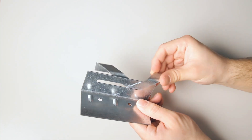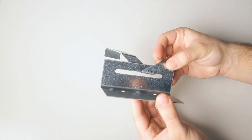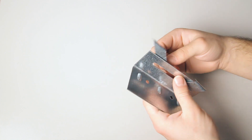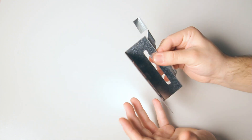Here I've got a clip designed for expansion and contraction. It generally sits close to the roof deck, allowing the clip to take the assembly's thermal movement. There are different styles, including sliders and butterfly clips, and they're usually used in mechanically seamed systems. Sometimes they do have to be assembled, like this clip here, and they are more expensive than fixed clips, which is what we'll talk about next.